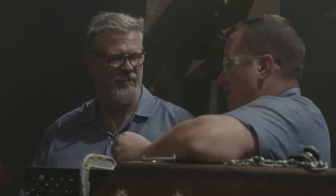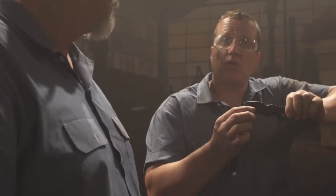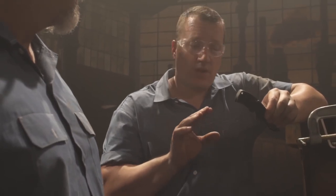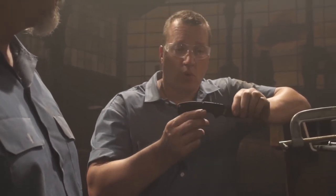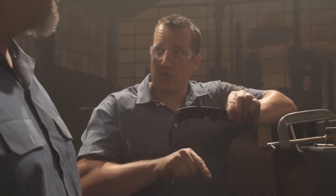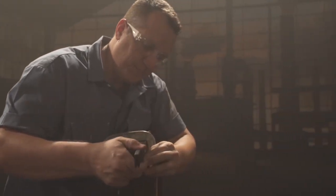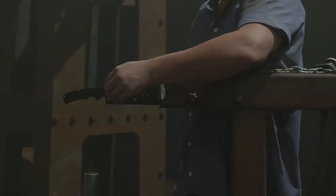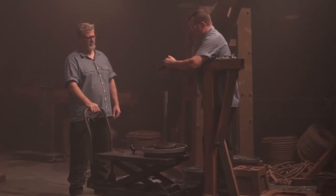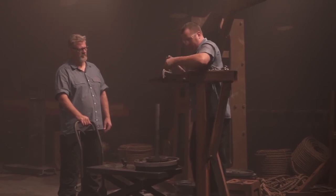100 pounds for a four-ounce knife. Now our lever length here is about four inches, so this 100 pounds, if successful, will be 400 inch-pounds of torque on the locking mechanism. You still want to do 100 pounds? I think it'll handle it. Okay. So I'll just show that it's perfectly functioning.